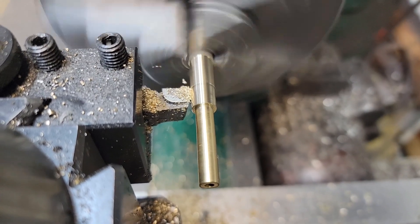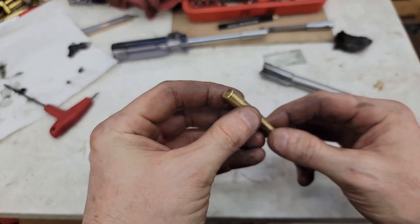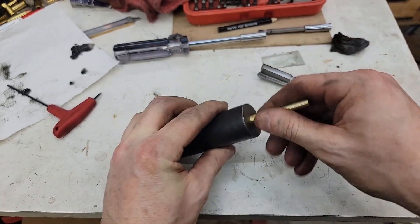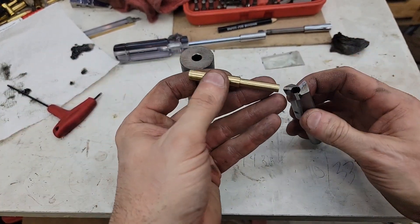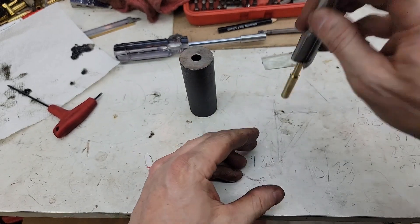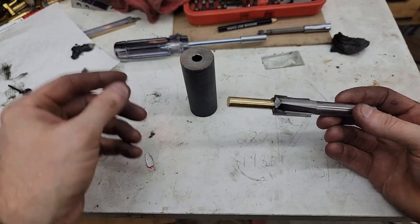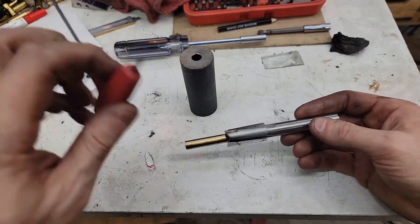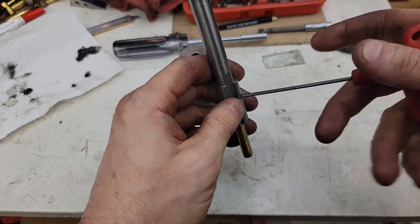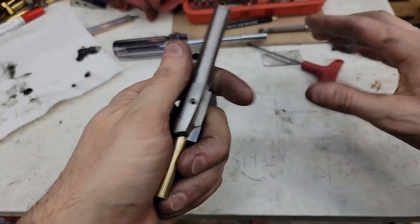I think that's the final cut, if I can get it done. So, here's our arbor, and that will fit inside a 9mm barrel, and we'll go inside of this here a drill bit. Then we can crown, maybe not this barrel, but a normal barrel, and retouch the end of the barrel — for anything that needs a quick touch-up.